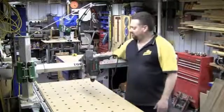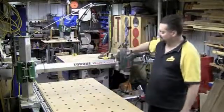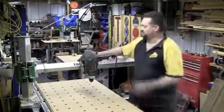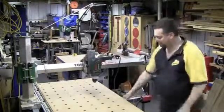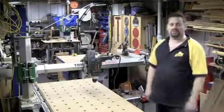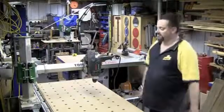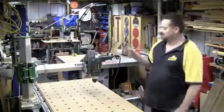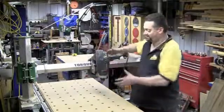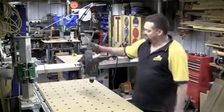The second is the Y axis, and the carriage can actually travel up and down the beam. If you choose, you can unlock both the X and the Y and have them both moving together — quite often when you're doing a surfacing operation, that's a common thing to do. But I find I like locking one axis and using the other for the majority of movements, then moving the tool along the Y axis, locking that off, and doing the X axis passes again.